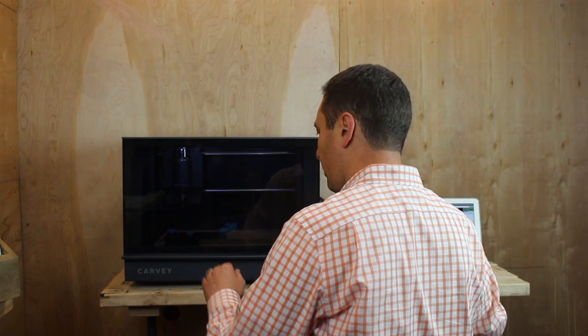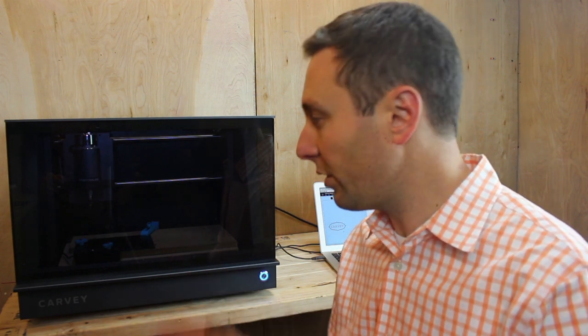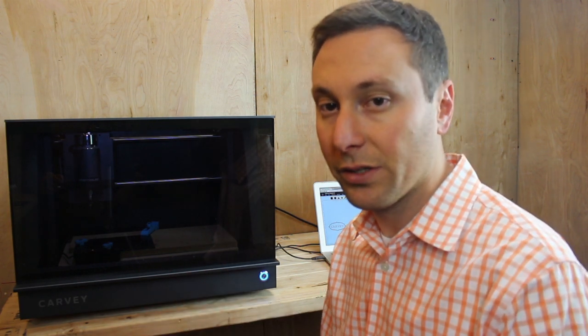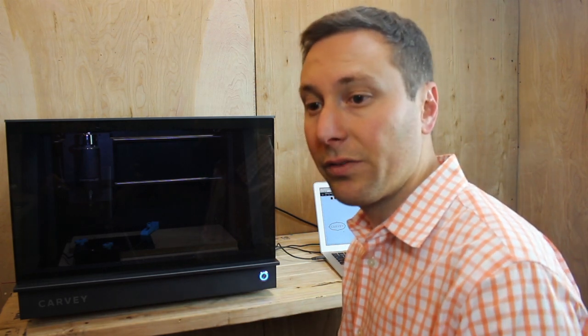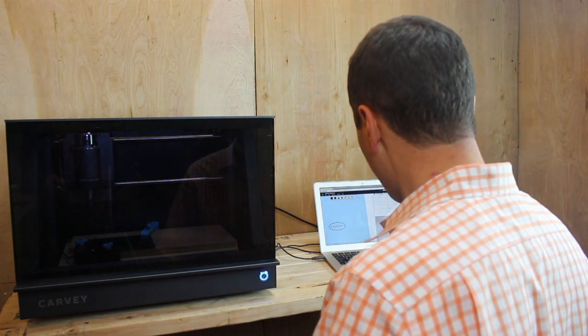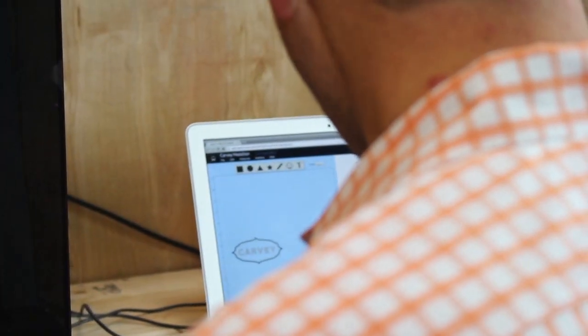This particular material is a thinner one. Later next week we're going to order some materials from other places besides Inventables that are a little bit thicker, so we can demonstrate how you can do thicker metal materials. We're also going to order some different bits, because one of the big things that impacts how well Carvey can cut is not just the material but also the bit and how fast the speeds and feeds are going. So for this first test, just to demonstrate how Carvey works on a thin piece of anodized aluminum, we're going to make the medallion. I've loaded up Easel, picked aluminum from the materials menu, and the speeds and feeds are all set.